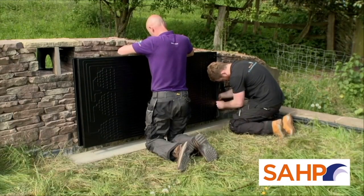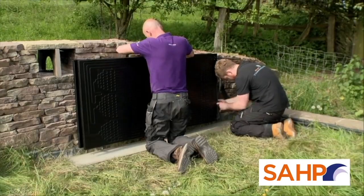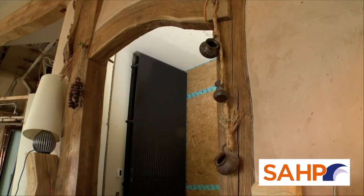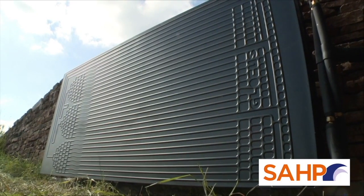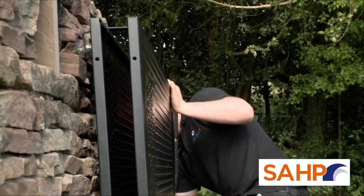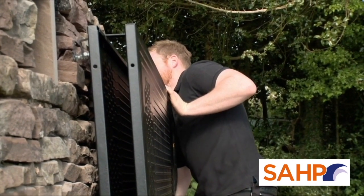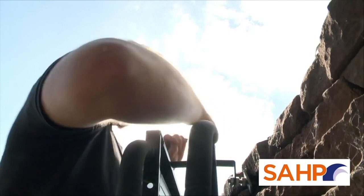The thermodynamic panel, or evaporator, has been designed to maximise the absorption of energy to evaporate circulating refrigerant liquid in both portrait and landscape orientation. Here, we have two thermodynamic panels installed in parallel. The panel is lightweight, double-inflated, and made of 2mm thick aluminium for strength and prevention of corrosion.